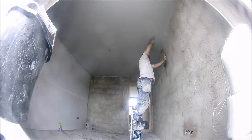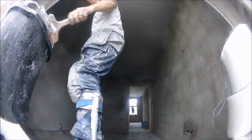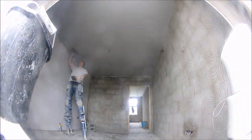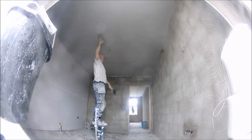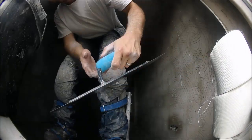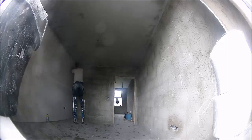You don't want to leave any water marks on the ceiling as they will not paint out. This is the second trowel, and the next one is the third wet trowel. Lots of plasterers leave it at that without shining or polishing the ceiling, which is perfectly okay. But if you're just learning, I'd recommend you give it a bit of a dry trowel — you don't want to over-shine it, but the dry trowel will make sure there are no dirty water marks and any blemishes will be taken out.